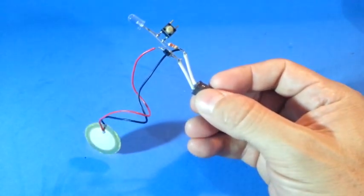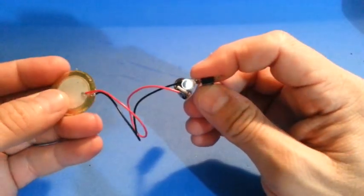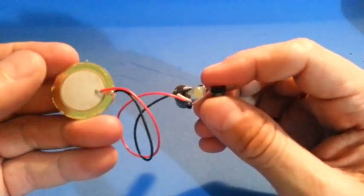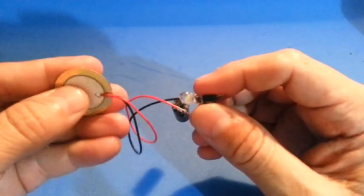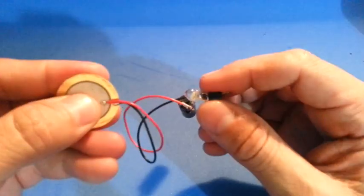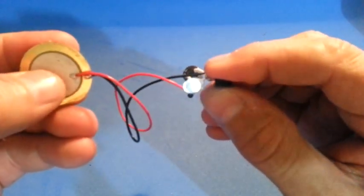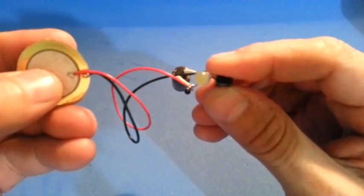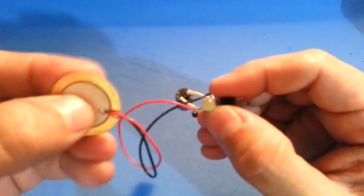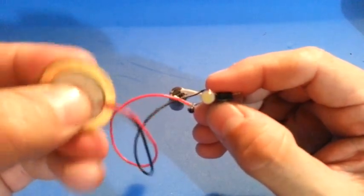Let's now turn off the light. When we press the switch, the energy stored in the capacitor is used by the LED. We need to charge the capacitor again, so we press the piezo and as we pump, the energy in the capacitor starts to rise. The capacitor charges and the LED lights when we press the switch. We can charge again and repeat the process in order to use the energy that we are producing with our element.